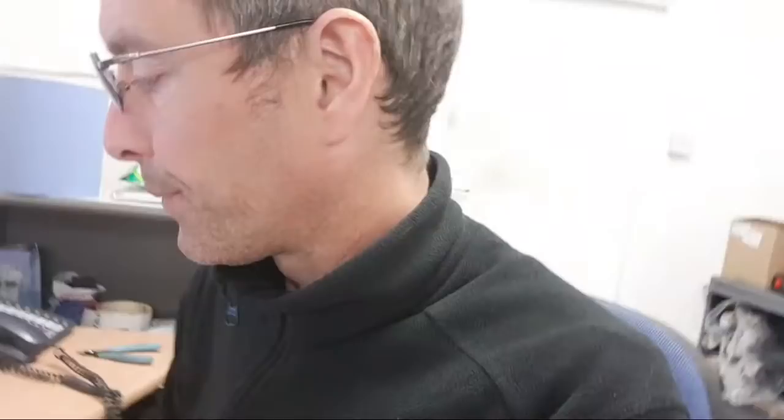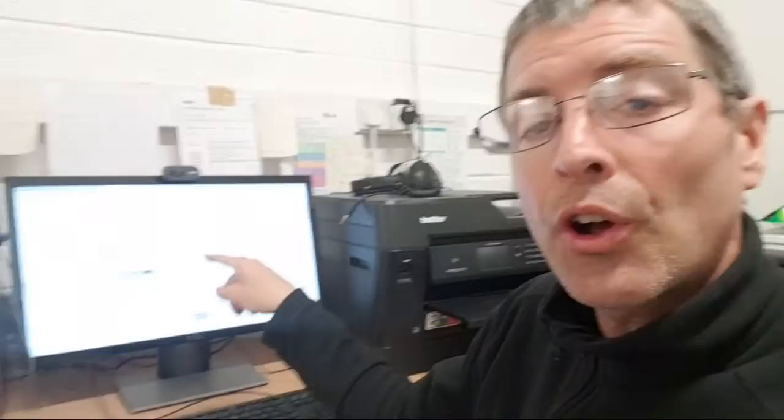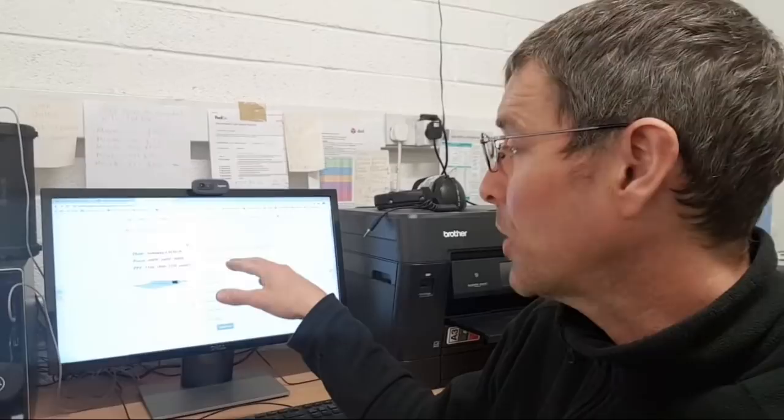Yeah, so I suppose where we're getting to now with this stuff is, hopefully you've noticed by the channel that when I'm testing, these are Samsung LM 301Bs. The efficiency as a grow light system is going to be very similar for all these configurations. So as long as they're providing what they say they're providing, these are going to be in the region of about 2.2 micromoles per watt delivered to the grow area.